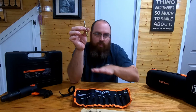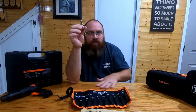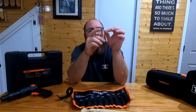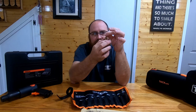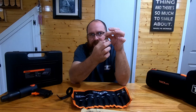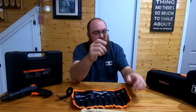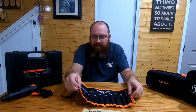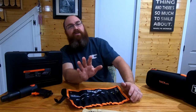These are designed for more intricate work like cabinet work and woodwork, similar to what I've done on this table here. If we had to drill and countersink screws, we have the ability with these to drill and countersink down and then come back and put a wooden dowel in on top to cover that hole up. That's kind of the key idea behind these, and part of the reason why I like them especially for cabinet work.